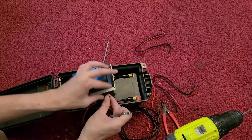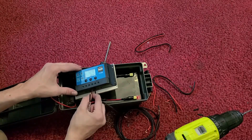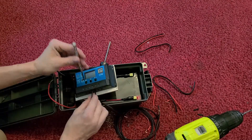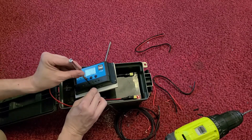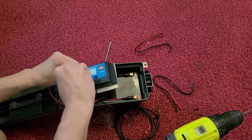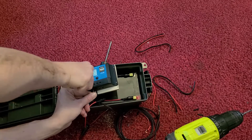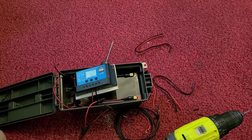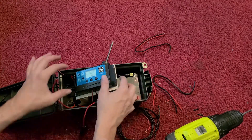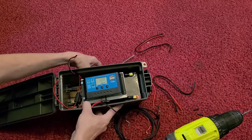Now we'll take the negative and connect it. You might ask why you can't just hook a cell phone directly to a USB port on the battery without the solar charge controller. Well, it's going to help you charge the batteries from solar. It also won't allow the battery to drain past 50% or pull more power than that — so it saves your battery and keeps you from torching it. Whereas drawing raw 12-volt power would cause all kinds of problems. So we've got the batteries hooked up, and you can see on the screen: 12.8, 12.9 volts — that is working.